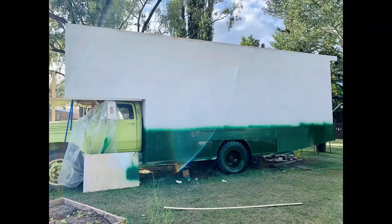You can totally use a water-based paint that you just roll onto your house, and it's probably going to work as long as it's outdoor rated, but the end result you're going to get versus what we did is going to be night and day, in my opinion. Water-based paints typically, I would say, have a more satin or matte finish, and I wanted a high-strength, high-gloss finish. Some people will think of that as for appearance, but high gloss also means it's going to make the house easier to clean and keep clean because stuff doesn't stick to it very well.